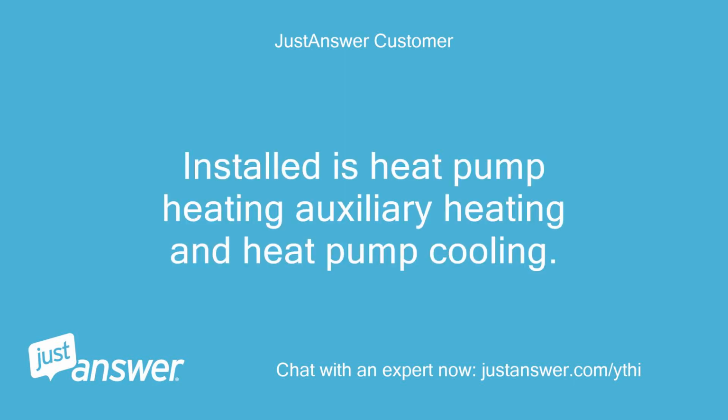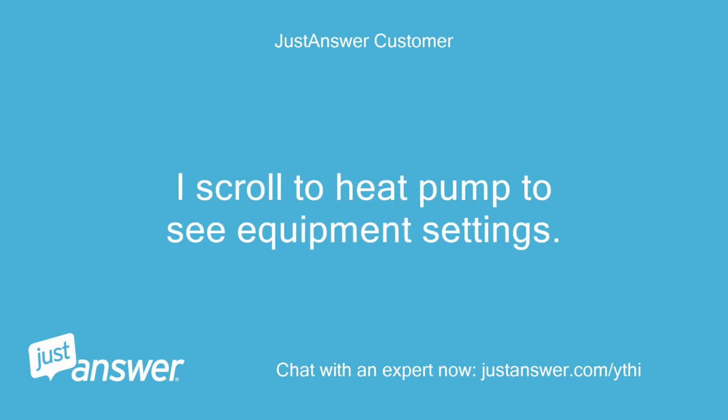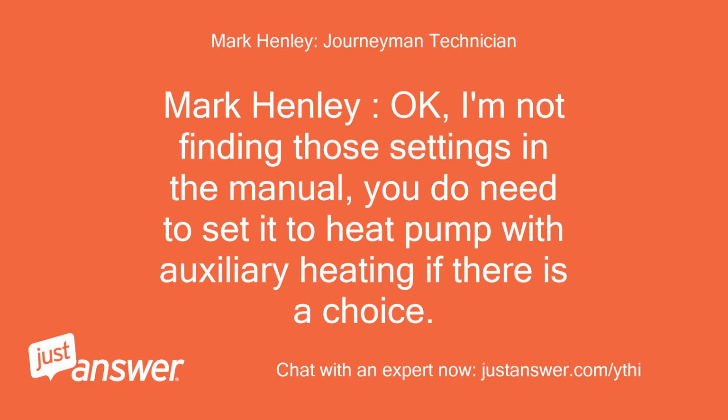Installed as heat pump heating, auxiliary heating and heat pump cooling. I scroll to heat pump to see equipment settings. Mark Henley: Okay, I'm not finding those settings in the manual. You do need to set it to heat pump with auxiliary heating if there is a choice.